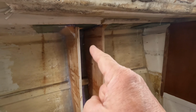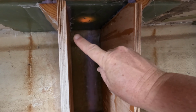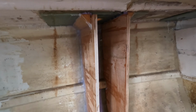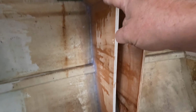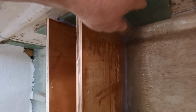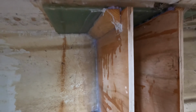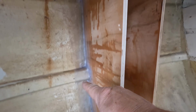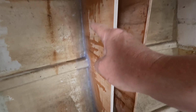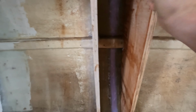This is port side. The cap shroud comes in through that lighter bit there, so the big knot will be under there. I've fiberglassed yesterday the outside on the aft edge and the outside on the forward edge. I put this triangular piece of pine with thickened epoxy and then fiberglass around it so that it gave essentially like a big fillet. Done that on both sides. Minimum of 3, often 4 layers of glass fibre tape, as well as the thickened epoxy fillet down those edges, and they are very solid. Very happy.